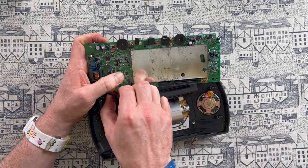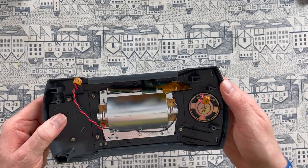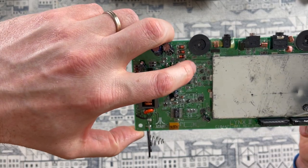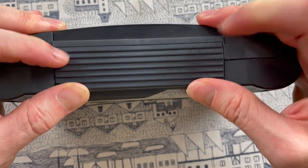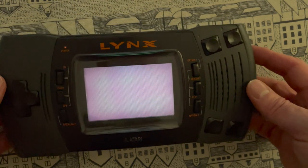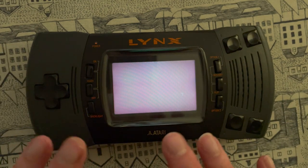There's the famous backlight that sucks all the energy out of this, but I'm just going to disconnect the motherboard and take a look at the front. Now underneath this piece of plastic is a membrane that can go wrong, and here is where the power circuit lies — this is also known to go wrong, in particular this diode here. Loading it up with batteries — it's powering on, there is some life in it, but nothing else happening, no sound, no games playing. The Lynx 2 won't power on without a game inside but it seems to be completely dead.